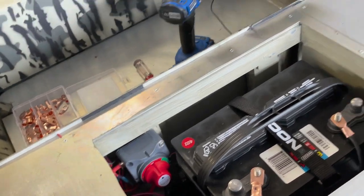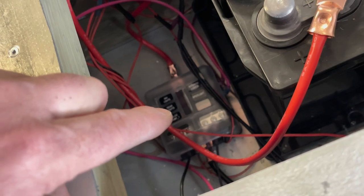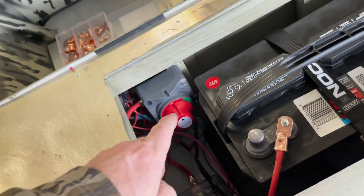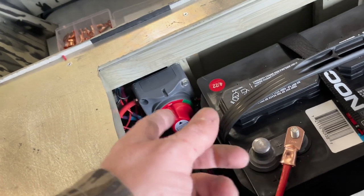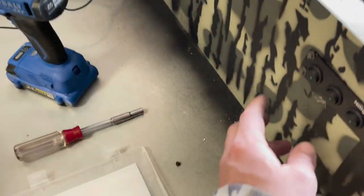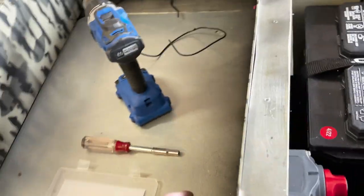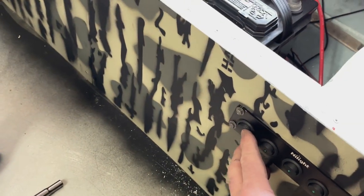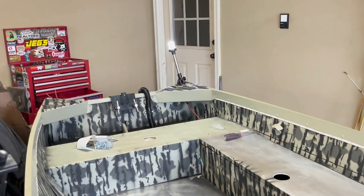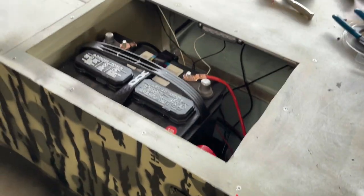So you run whatever you're trying to power to your switch, and then from your switch you run to your fuse block, and then your fuse block is powered to your kill switch if you're running the kill switch, and your kill switch goes to your battery. Right now I've got the kill switch off so I shouldn't be able to turn anything on — see, nothing's coming on. Now go ahead and turn your kill switch on, giving power to your fuse block — everything should come on now. So you got a little light on, anchor lights on, and my navigation lights are on.